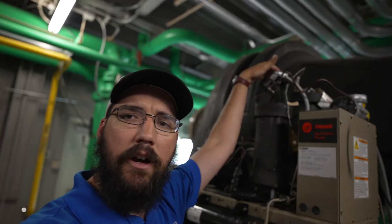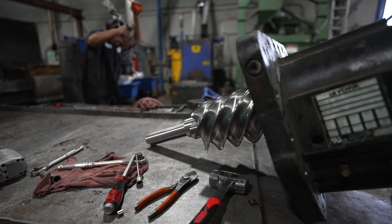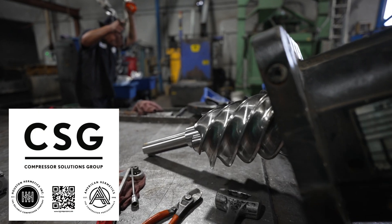My metering valve up top was freezing over really bad, and my liquid line temp here wouldn't even get down to the ambient in the room, meaning it was still fairly warm. I was not kicking out any warm air out of the purge condenser. I went through all the steps, verified flow balancing on the chiller barrels, and ultimately what my purge was telling me was not matching what my chiller said was actually happening.